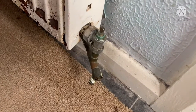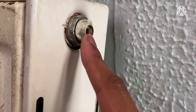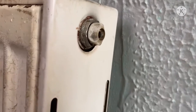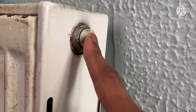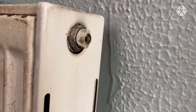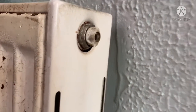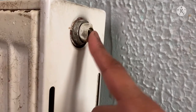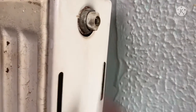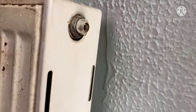To aid the process of removing all the water, what I tend to do is go to each radiator and using one of those radiator keys I loosen the bleed valve slightly. These are the bleed valves — you don't need to take them all out, just undo them slightly to let air in, which helps drain the water out.